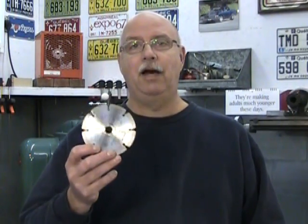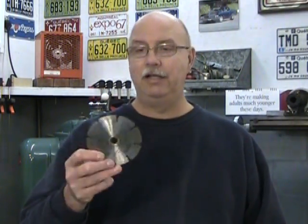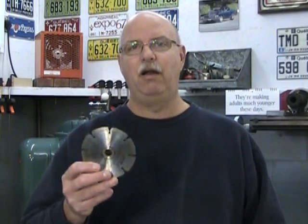The next most obvious reason for poor finishing while surface grinding would be shot spindle bearings, and you can check that with a dial indicator and check the specs of your machine with the manufacturer. The next most obvious reason would be the use of an inappropriate grinding wheel. We have many types of grinding wheels. We have metal diamond grit cutting wheels, generally reserved for cutting ceramics and carbides — very hard materials. We also have fibrous grinding wheels that are tough but not very accurate, and they heat more than they cut, reserved for rough grinding with angle grinders.